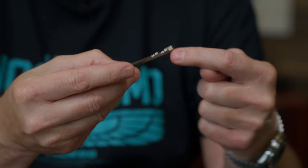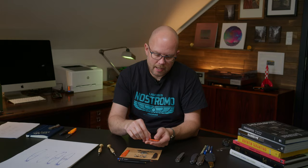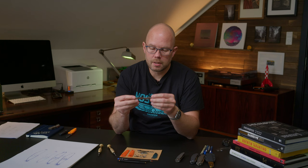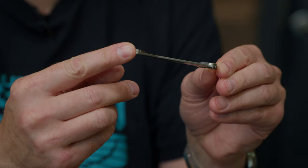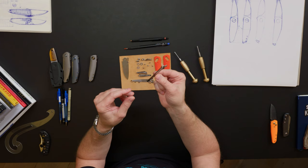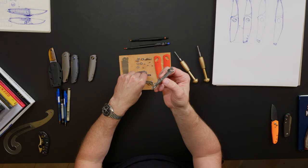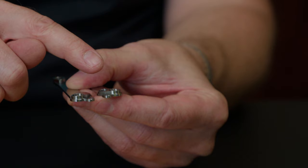It's then reduced to two millimeter thickness for the main body, but you have these small islands that go through windows in the handles. One of the things I really enjoy about this is that you would be hard-pressed to see anything like that in a standard production knife, just because this is an extremely expensive way of reducing a chunk of titanium — it's a really expensive detail to have the pivot and button detail go all the way through.